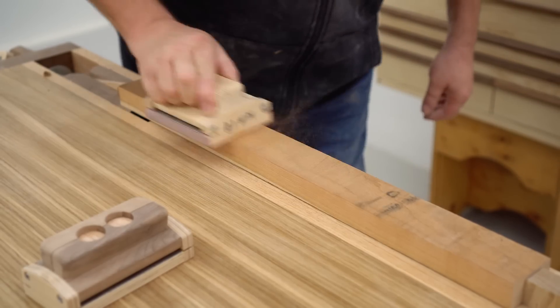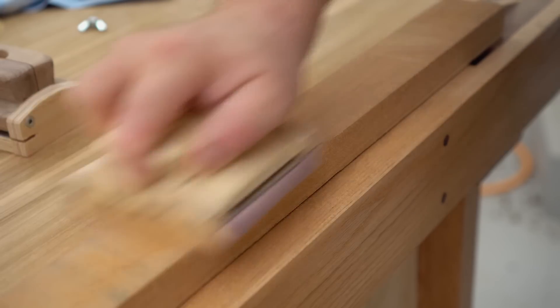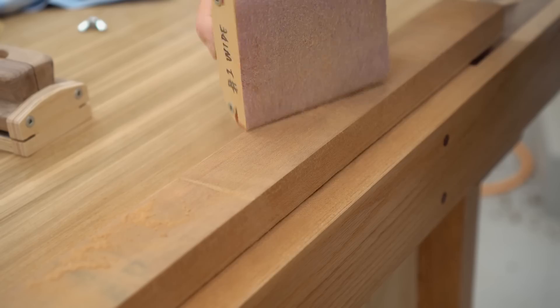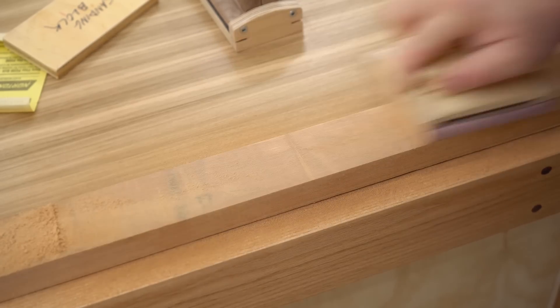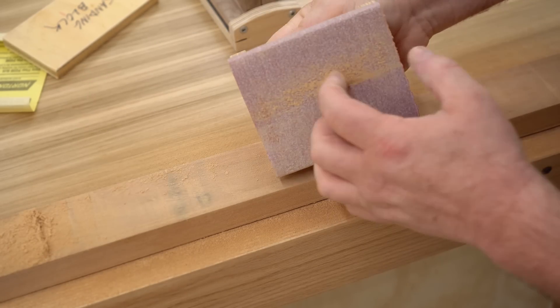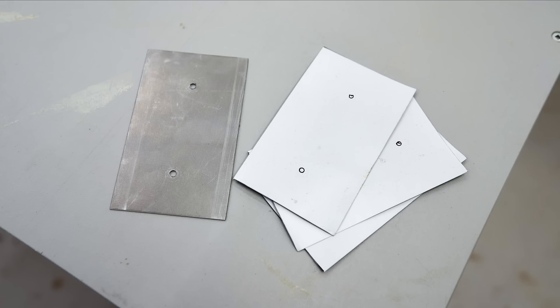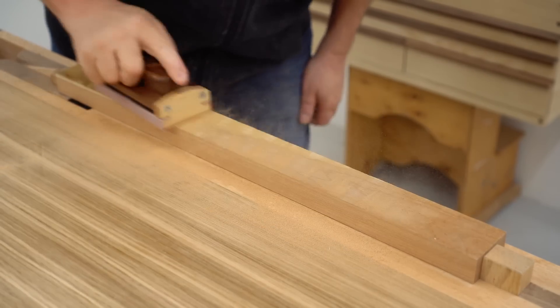As you can see, the paper came out, which was kind of unexpected. Before this I built a prototype and that's what you're watching me using here. The difference with this one is it's actually wider — I oriented the sandpaper sideways to get a more square pad. What that does is it makes that steel plate wider and easier to bend down and easier to clamp down on the sandpaper. In the narrow one that I just made, that plate is simply too stiff; it takes too much force to bend it down. So to fix that, I'm going to swap it out for layers of thinner aluminum flashing. This is stuff you can get at the home center in the roofing section. I'm going with three layers, which is actually slightly thicker than the steel I had, and when I tried it out it works great — it has a really good grip on the paper.